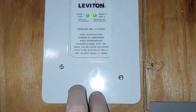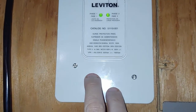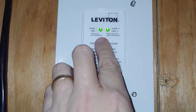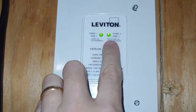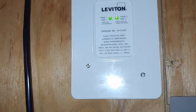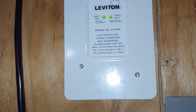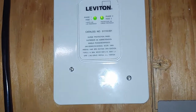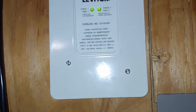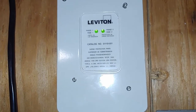Basically it takes the hit if there's a surge anywhere on your system, even coming into your system. After a while these can wear out. How you know it's protected is that both legs are protected when these lights are lit up — in this case they're green. My other surge protector is red when lit up. If one of those goes out, that means you need to replace your surge protection device. Depending on your situation you may never wear it out, but you can look at a glance and see if it's protected.